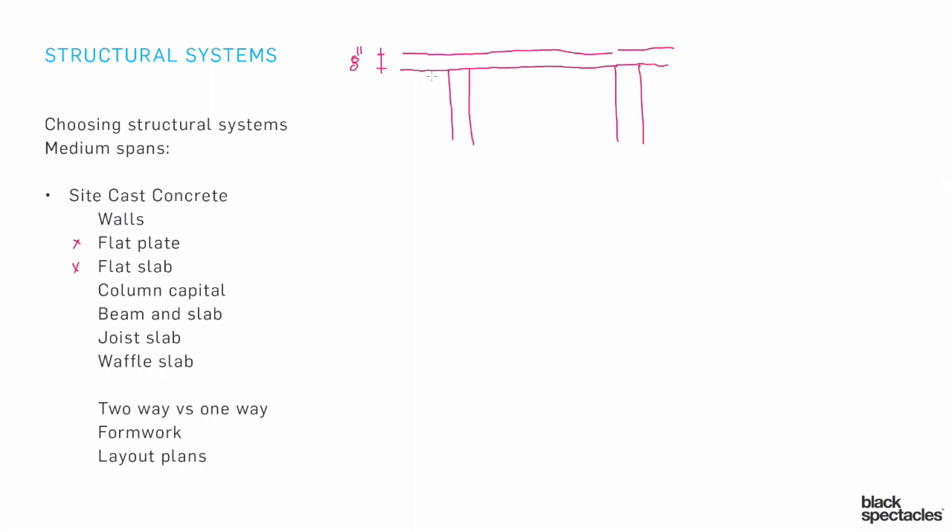If we were looking at the reinforcing bars, you would find quite a bunch of reinforcing at the top, quite a bit at the bottom, some that go up and then down, some that go down and then up. But there's also a huge amount of reinforcing that goes down into that column — a lot of action happening with the rebar at that one spot. The cage reinforcing for the columns continues down to the next level. The great thing about concrete is that everything becomes one structure — it all ties together.